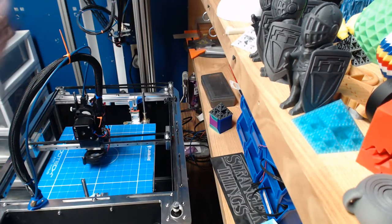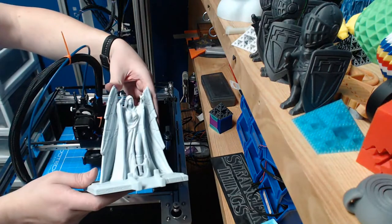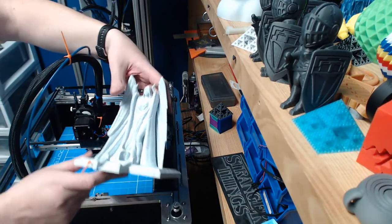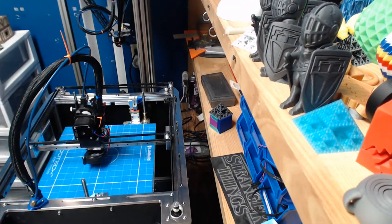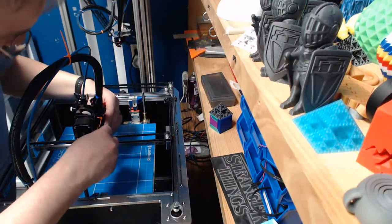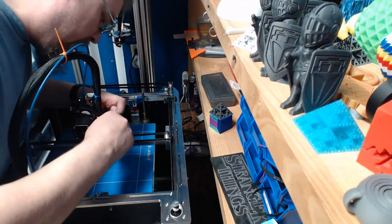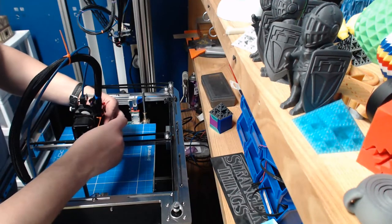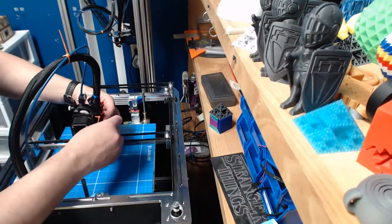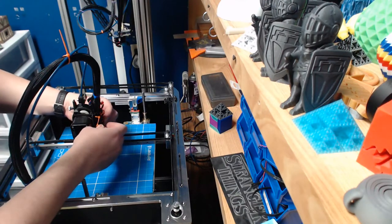through this print, which was 22 hours. Through that print, it sometimes reported only 5% moved of what was expected, and other times it said 130% moved out of what was expected. And it varied pretty constantly throughout the print. It wasn't based on speed, wasn't based on anything other than randomness.